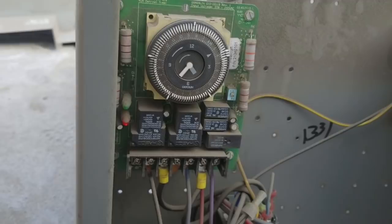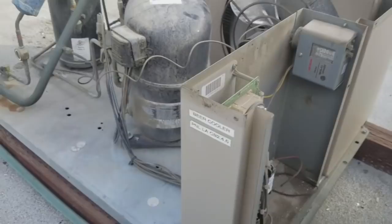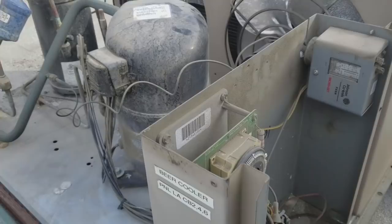All this before I change fuses is because — why waste a fuse? Why potentially blow a main breaker? We're going to double-check everything first. I opened up all the evaporator coils and did the same test — ohmed out each terminal to ground and got nothing, so I have no obvious grounded-out wires.